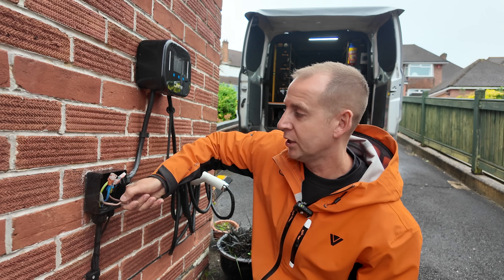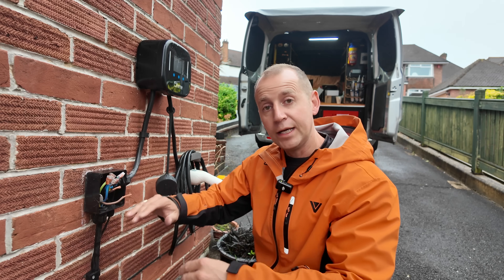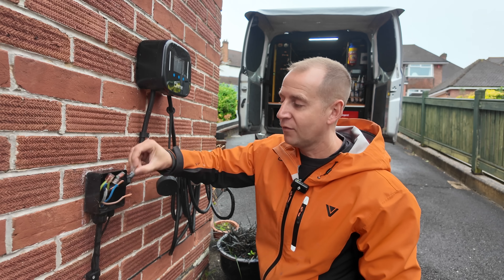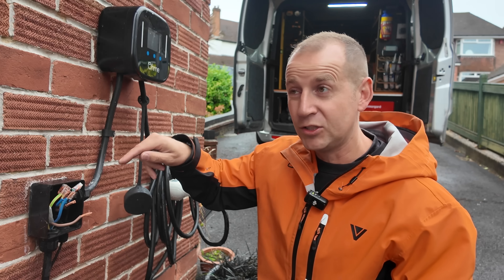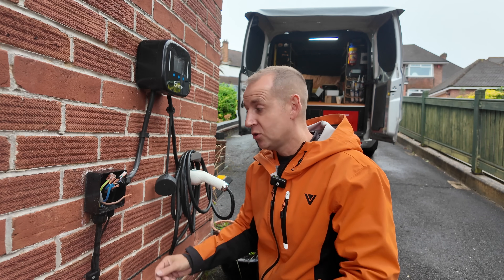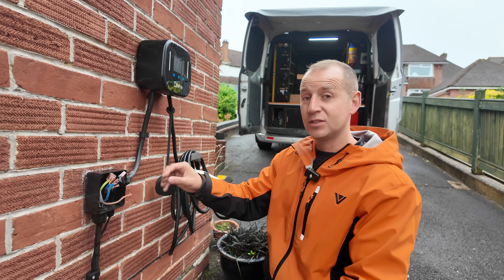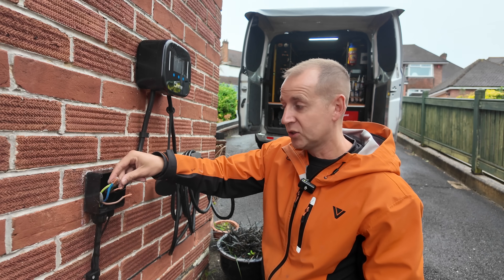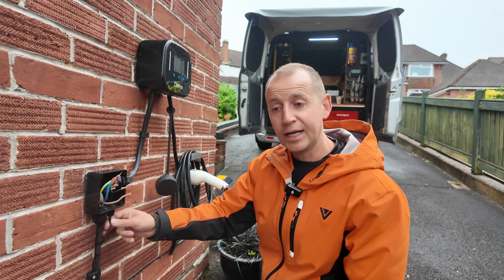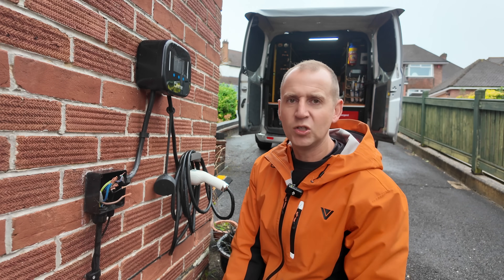Because this is a sealed unit and it's pre-flexed, the install cable is only this long, so if I want to install another charger I've either got to reuse the junction box which looks naff, or install a new cable which is what I'm doing today - customer's choice. They don't want this - look how untidy it looks. On the cheaper side of installs we have a flexi high-tough cable for the supply and a separate Cat5 which is just tie-wrapped along the cable - looks super tacky.